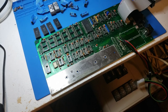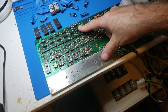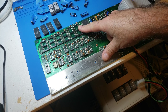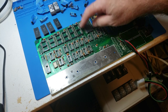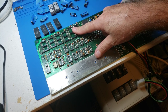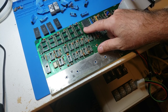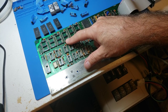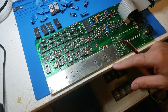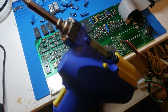Well, this looks nothing like the board you just saw. The original chip that was on here - the original ROM - had a broken pin and I looked at it and it was heavily corroded, that's why it was broken. Looking at the sockets here for the ROMs, they were heavily corroded underneath, and I couldn't see underneath to know if there was any damage to the traces. On top of that, the 2K RAM chip here had corrosion along the pins and underneath as well.